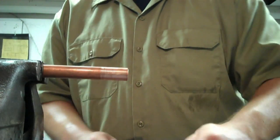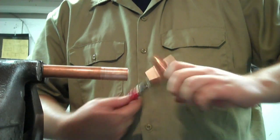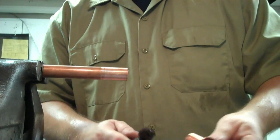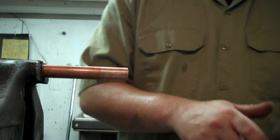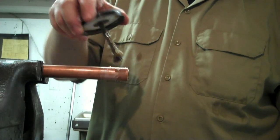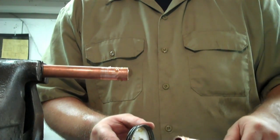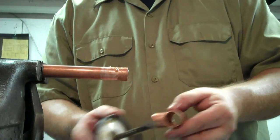Same thing with a fitting — you take your fitting brush and just go in here and rough up the insides. This is a brand new fitting so it doesn't need too much. I also like to do the faces of the fittings to help the solder take better. Then take your soldering flux and put a nice thin layer on all edges that are going to be soldered. It doesn't have to be too thick — not enough will hurt it but too thick won't. Flux all parts of the tee.